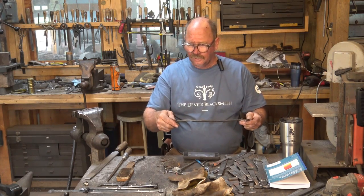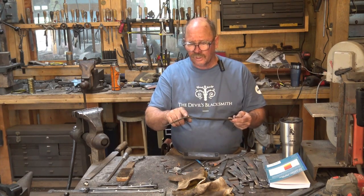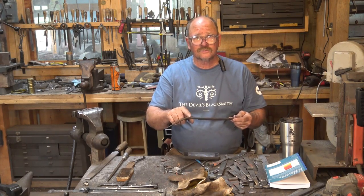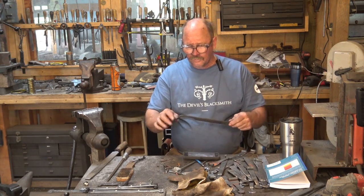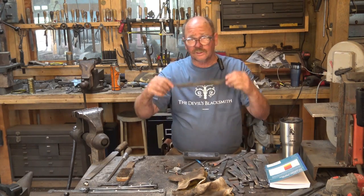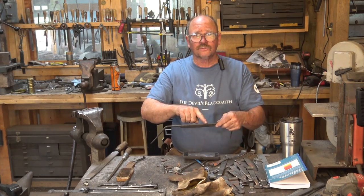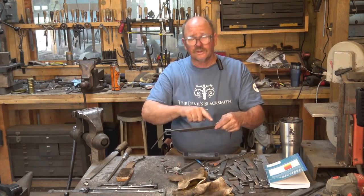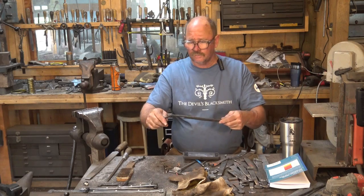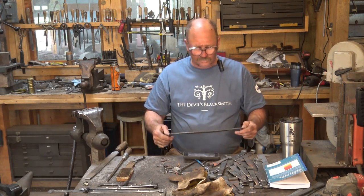You can do that. And if this is an all tool steel draw knife, if you took that approach, that does help normalize this bend a little bit, and this is one of the stress points. Another option, if you need to get them out of your way and you can't leave it straight because it won't fit in your quench tub, is to actually bend them all the way back on themselves so that they're parallel with the back of the blade, harden it, temper it, then again heat them with the torch, straighten them back out again. Lots of options to find your way around problematic things.